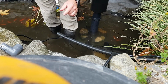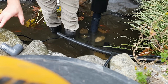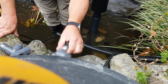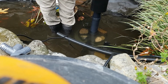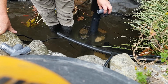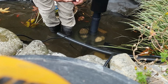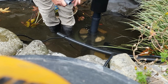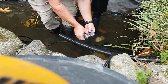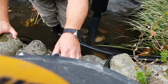The reason why is when they drill and tap a water main, they thread this in there and it's pointing in the right direction, ready to go. So that's why it got its nickname. So I'm going to put my bushing in, like so, that's the rig I made. Just spin that in there, and then I can point this any direction I want, and I will take these two, put them together, cut this back, and this will give me any angle I want to accommodate this goofiness, and that'll take all of that up.